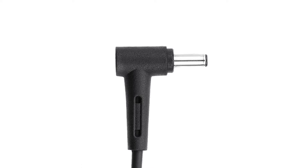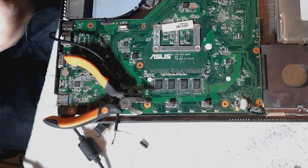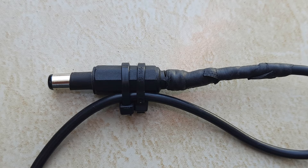Disconnect the electricity and cut off the original DC plug on the charging cable. Strip off the cable's outer sleeve to expose the positive and negative wires and solder them onto the new plug. The inner wire is positive, as is the plug's central terminal. Screw on the plug's sleeve, and I also wrapped some self-amalgamating insulation tape around the cable and the sleeve.